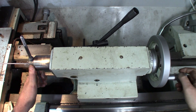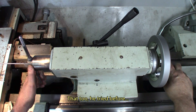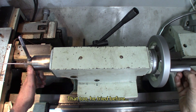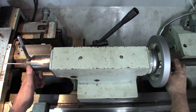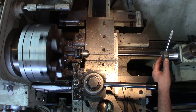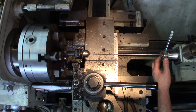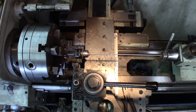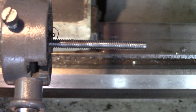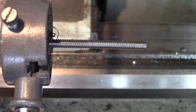Applying very light pressure — if I apply too much pressure I'm going to strip the thread, so just keeping it up. I've got a foot pedal on the lathe, so if I want to stop mid-process I can stop it, and that's it — hold the die. There we go, this is the thread coming out of the die. It makes a very decent thread.